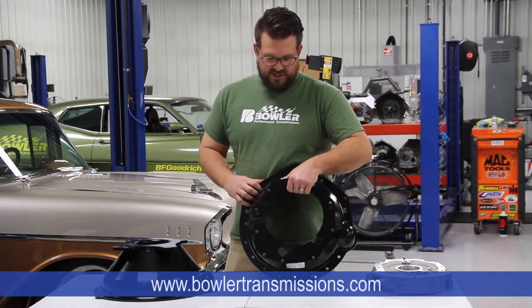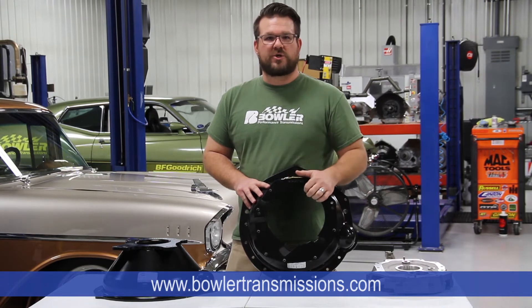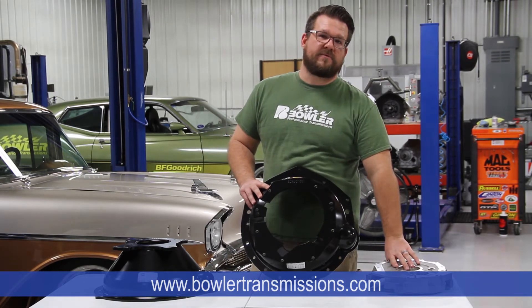The other style you'll encounter is for the Magnum 60. As you can see with this particular one, there are a couple different weird cutouts for the pump setup, for hydraulic lines, those types of things. So it doesn't give you a nice good circle to take that measurement from. In this instance, what we're going to have to do is actually remove the front cover from the transmission.